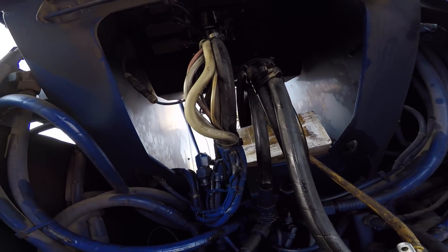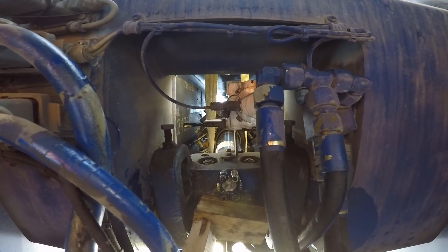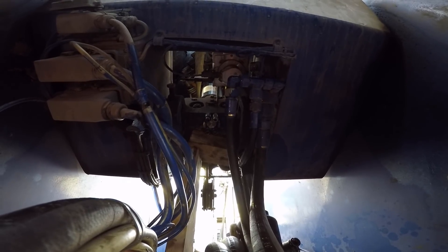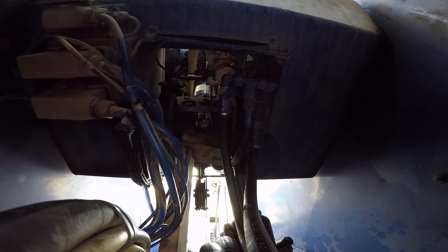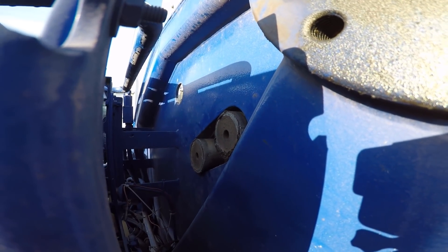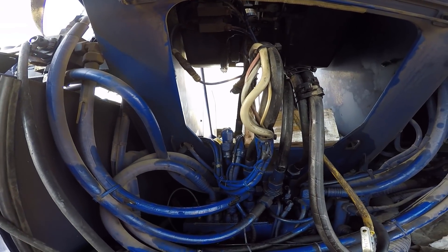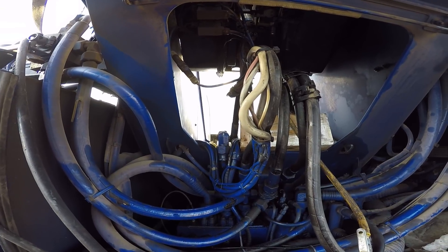So this telescope cylinder has been quite the ordeal. You can see it up into the boom, but this cylinder doesn't come out as easy as what we thought. You've got to boom the base section of the boom up to about 50 degrees to get access to the pins that hold the telescope cylinder in place. It has been quite the challenge getting this thing apart. But we're almost to the point where we can fix our $1 or $2 o-ring that's leaking, after spending a 10-hour day working on it yesterday. Hopefully we get this thing done today.